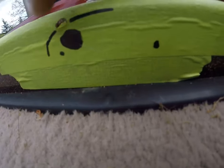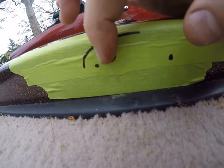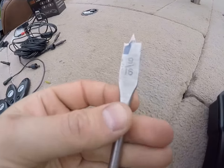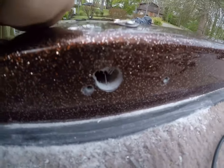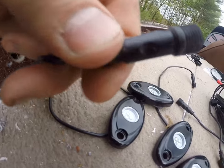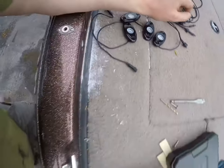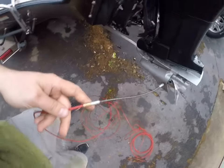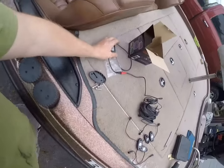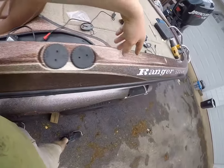As far as installation, it's pretty simple. I put some masking tape on the boat to mark it, then you've got your two screw holes and a 9/16-inch hole to drill for the wire. I use a 9/16 spade bit — you can use whatever kind of drill bit you want. You need the 9/16 because the connector end has to pull through that size hole. For running the wire, I use a fish tape from Harbor Freight — just tape your wire to it, pull it back through. I'm going to mount my control box underneath the seat and run my wire around to it.